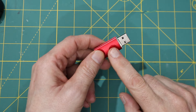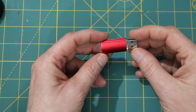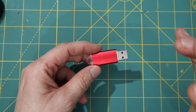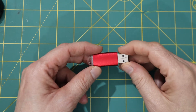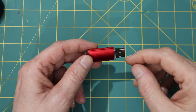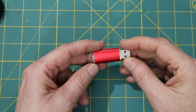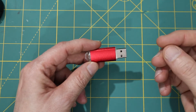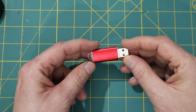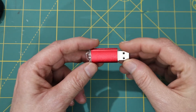This is how I get programs to my CNC machine from the computer. One of the interesting things about dealing with older machines — my machine is a 2009 machine — is that technology has changed a lot since then. The Haas OM2 I have has a limitation of 2GB max for a thumb drive; it can't read anything larger than that. It also has to use a format known as FAT instead of FAT32.